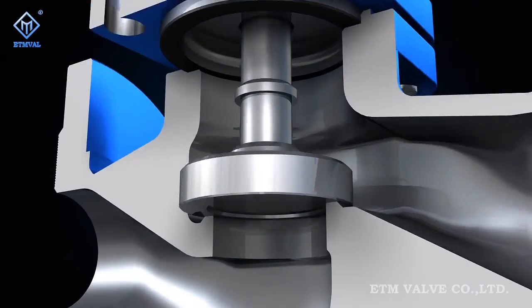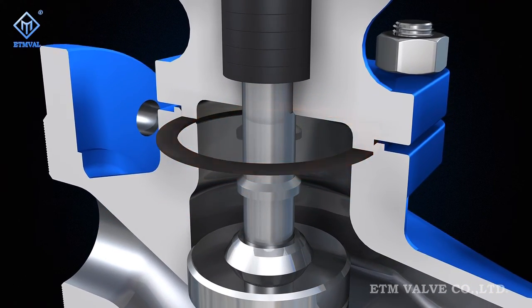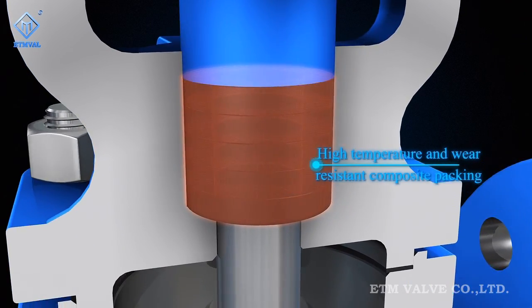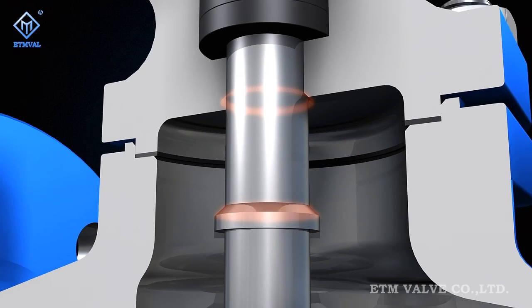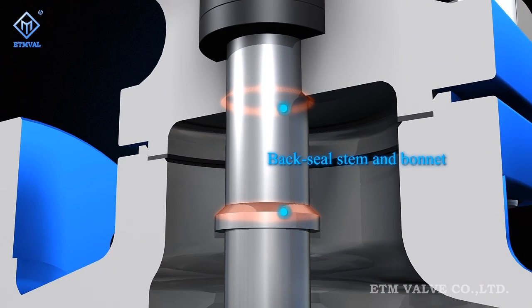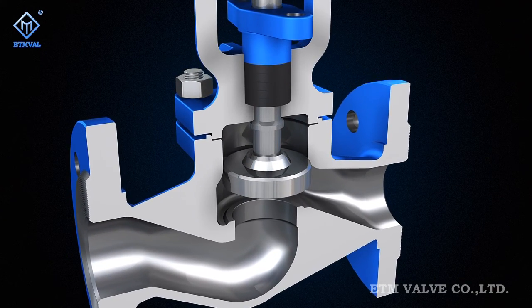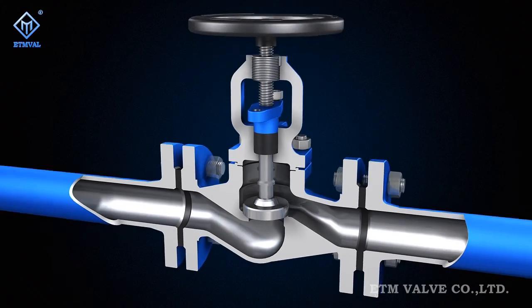The intermediate gasket is made of high temperature resistant metal composite. The gland packing is also of high temperature and wear resistant composite. Both the stem and bonnet are designed with a back seal fixture, which will collaborate with the gland packing to form a double sealing effect when the valve is being opened, thus providing stem zero leakage and ensuring valve reliability in sealing.